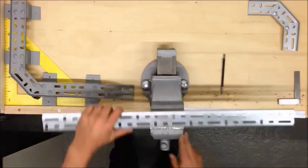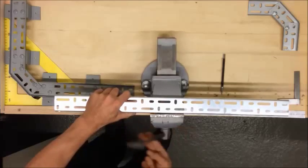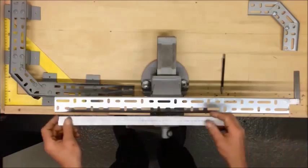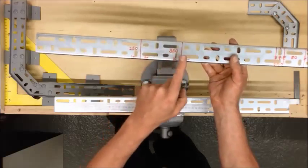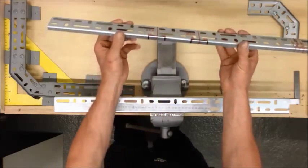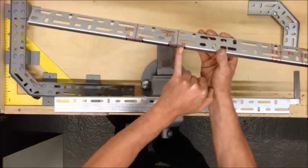The length of cable tray I'm going to give you is 700mm long. Your first point of the swept bend is going to be at 250mm, your second point of the swept bend is going to be 350mm. At both of those points you're then going to cut off 20mm of flange either side of that centre line.